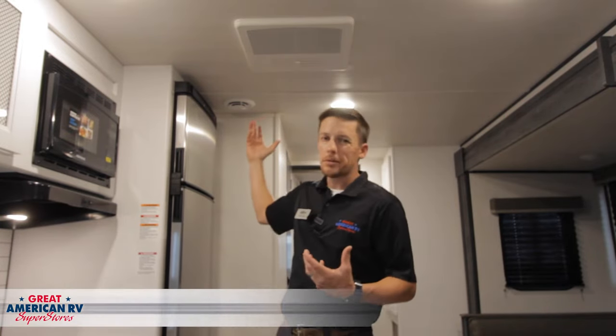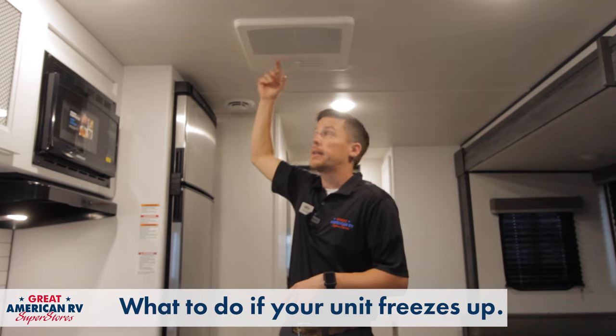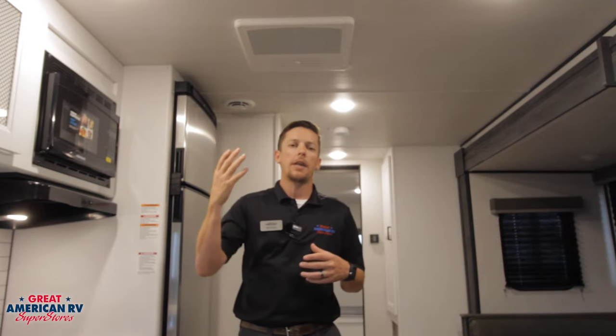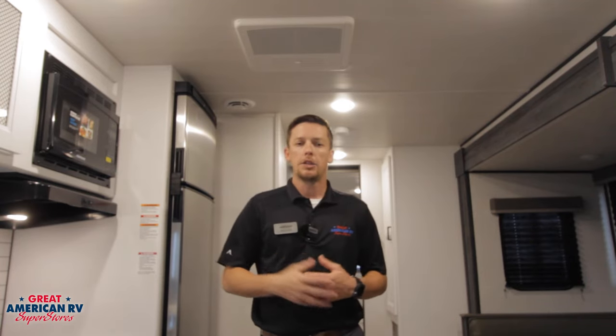Let's say we hear our compressor running but it's putting out only slightly cold air. At that point, we want to go ahead and pull that filtration system off. If we have the ceiling assembly inside, check our coils and see if they are frozen over. If they are frozen over, running that fan on high — we want to go back and make sure our fan is on high. Turn the cool setting off. You'll have to allow that AC to run probably 30 to 40 minutes before it will defrost and get all the ice off those fins so air can circulate back through. Keep the fan on high — this will allow those fins to dry off in between compressor cycles. It won't completely rule out the AC freezing up, but it will help reduce it. Once those fins have dried off, kick the cool back on and let your AC run like normal.